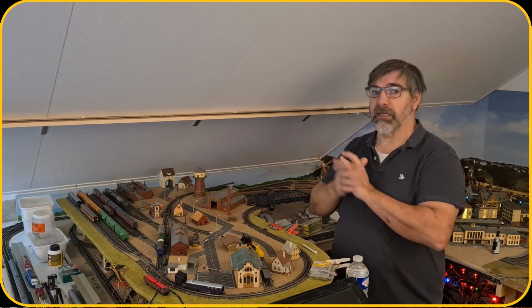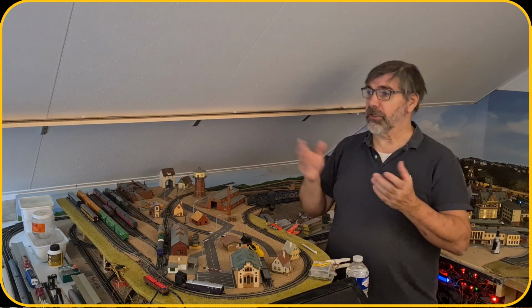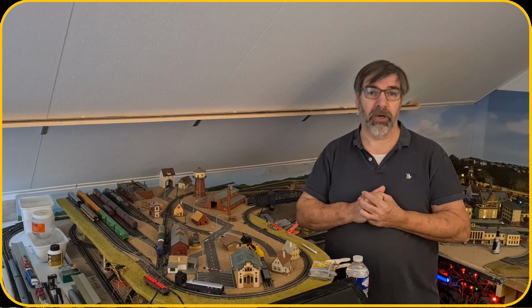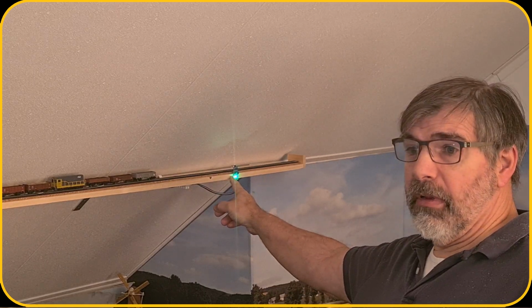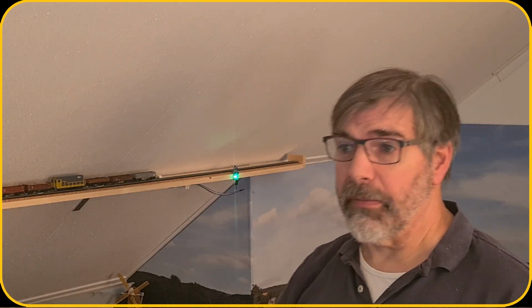And then let's discuss on what I'm going to use this track for. So it's not only a shuttle track, but it will be used for many different purposes. As mentioned earlier, the infrared sensors are not all that good in a bright environment. The sun is shining outside and it is reflecting towards this wall. And as you can see, there is no train here, but still the sensor detects the information or something.